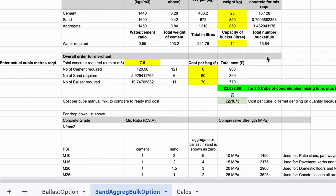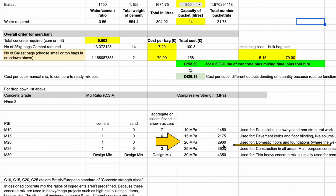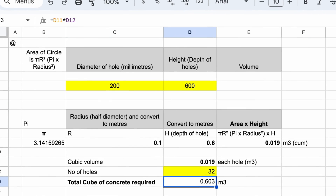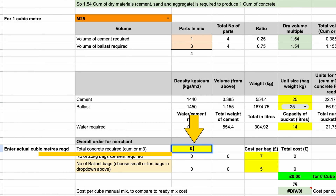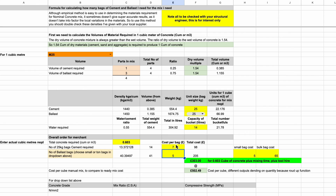Let's use these mini pile foundations as an example and take you step by step through how I use this spreadsheet to get my mix and quantities. Here's the strength I need, and from the drop-down list here's the mix. From the volume calculation I explained earlier, here's the cube which we enter in the yellow box. With all those variables in place and entering the info into the yellow highlighted boxes, the formulas will automatically populate the remaining variables. At the end you'll find the number of bags and cost of each, and here the overall cost for your particular situation. I put the current cost for sand and ballast linked below in the description — just update it if prices have changed or if you can find these materials cheaper in your area.